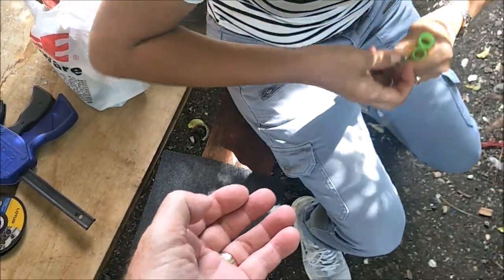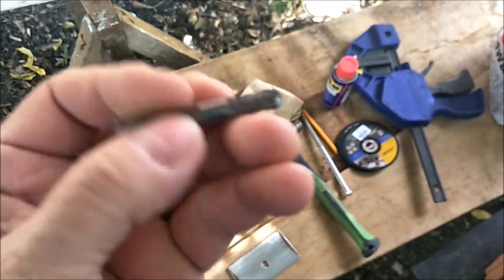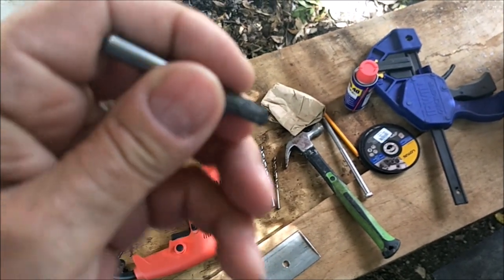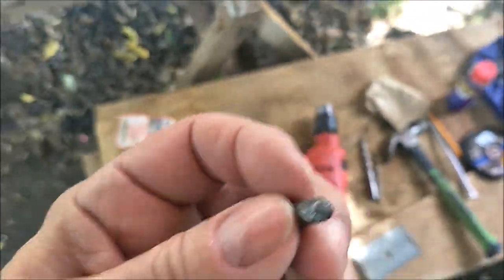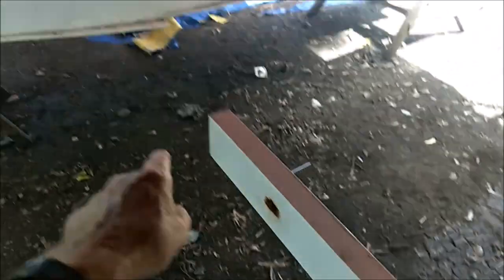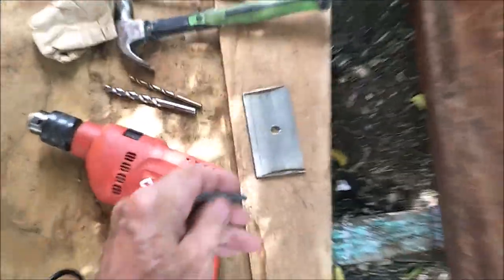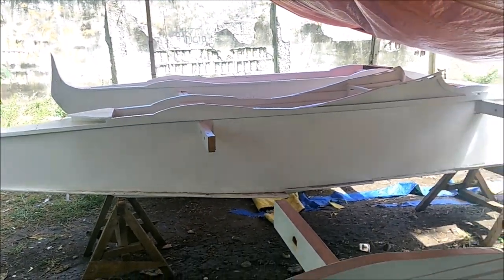Yeah, here, this is the carbide cutter, and we got the rounded end here because you can actually almost drill with this. It's not good for drilling, but you can drill. And we also label these ones here because, like I showed you before, this is number one. It's got one indentation there. That's got two on the other side of that. That's number two. That's number three. This is number four. So each of these little blocks we number, and we take this drill bit and put one right there, or two, three, or four, whatever is the appropriate one that it matches up with.